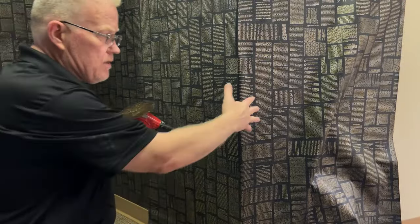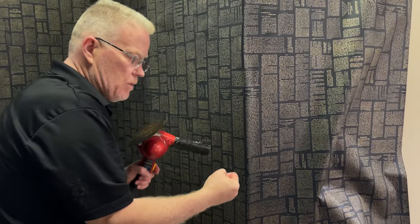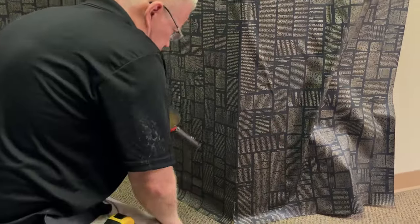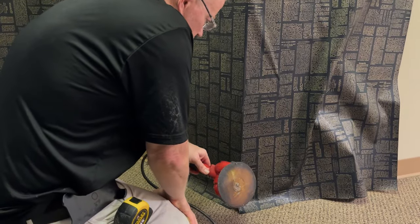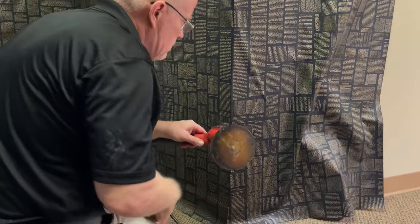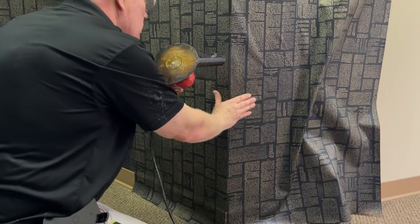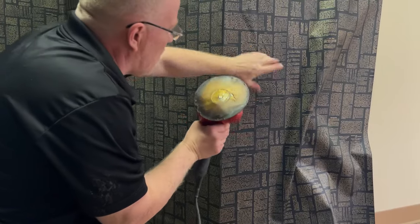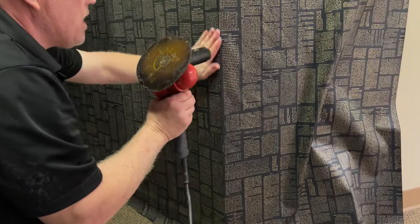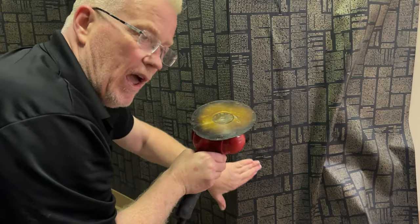Now with a sticky hand, and this wallpaper shouldn't be wet, I'm going to now stretch it by pulling this side and making the wallpaper really adhere to this corner. If you don't do this, you will have a fat corner. See all the space here? All the wallpaper, I mean? If you leave that there, it sits in that corner and air collects underneath it.